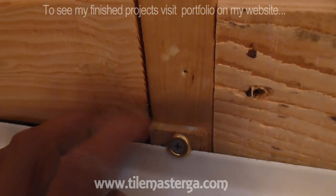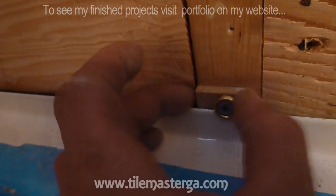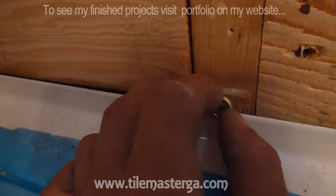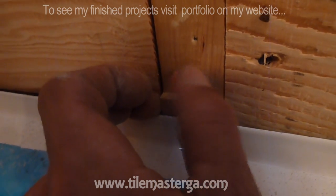And here I'm going to notch the board. You see I have to push the tub away from the studs about a quarter of an inch. I have a shim. So the board here is going to be slightly notched, simply to not sit on top of that. If everything's fine, if the wall has been framed correctly, this lip is actually supposed to go right against the stud.